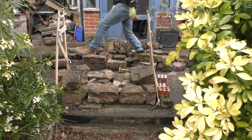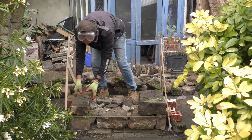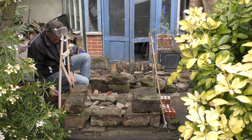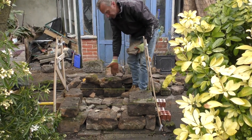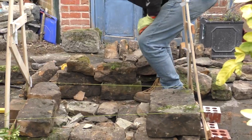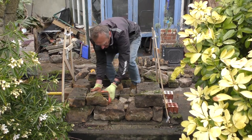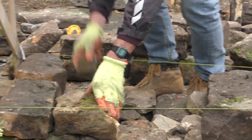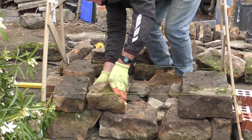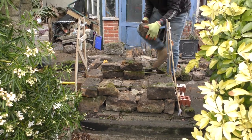I need a piece along there as well, so a couple of decent pieces now. The important thing is to keep a nice clean passageway — you normally need about two feet between the wall and the stone so you can walk freely and see what you've got. I'll level up this one a little bit. I've got a piece which will go in there, pull it back to the line. We need to put some packers at the back to get it all nice and firm. Then we'll drop a piece to bridge the gap there.